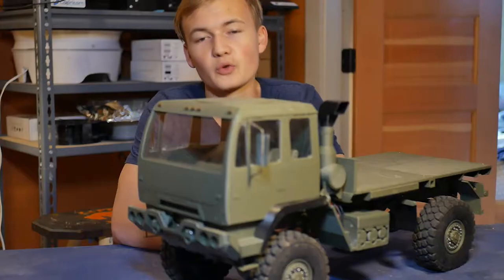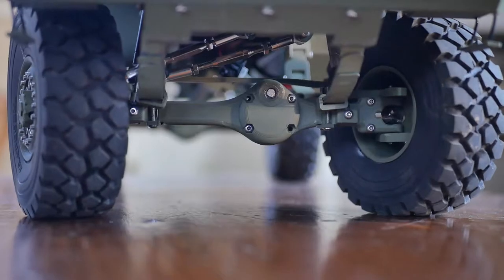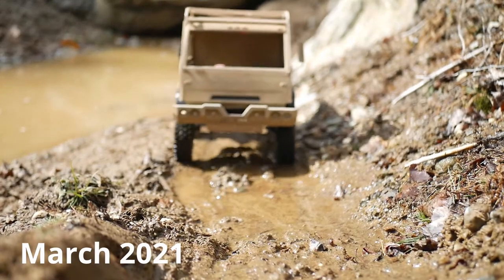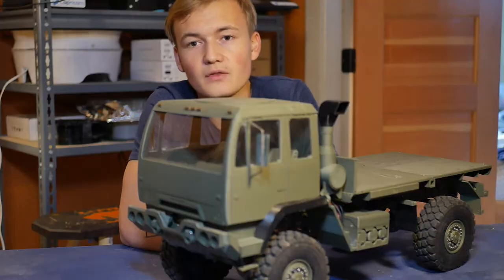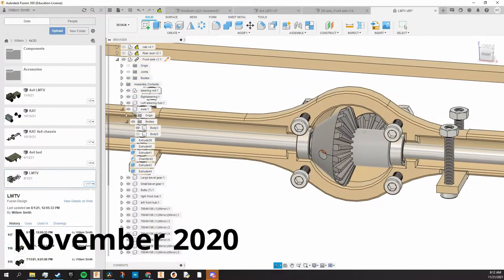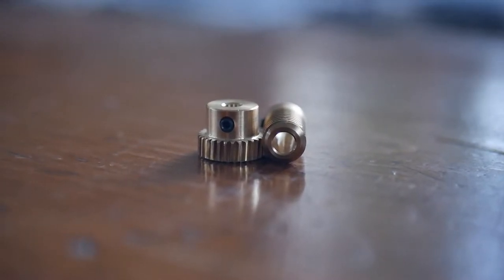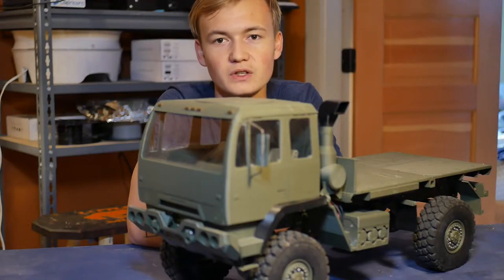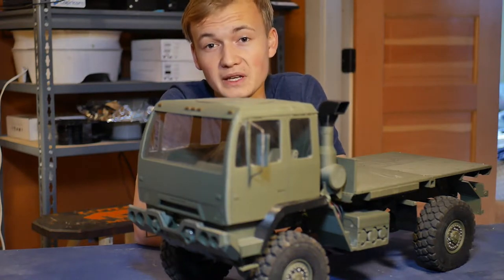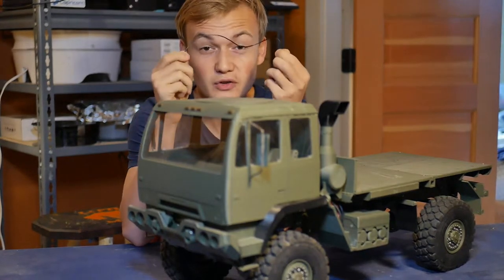The appearance is only half the battle though — where the real thinking happens is the mechanical components. In order to get this thing to the level where it is now, robust and capable, I've had to re-engineer the drivetrain, suspension, and steering several times. In my first tests, the truck used 3D printed bevel gears in its axles, which have since been replaced with brass worm gears. The bevel gears were cool, but they just couldn't handle the strain. Along the way, I noted that TPU actually made the strongest gears — that's right, this flexible stuff makes strong gears.